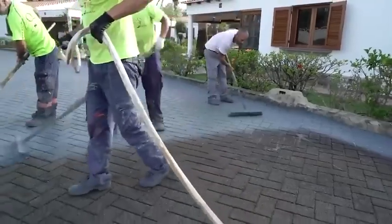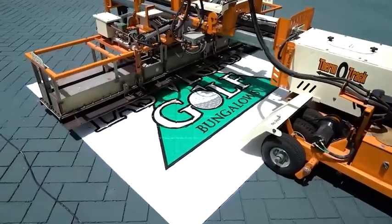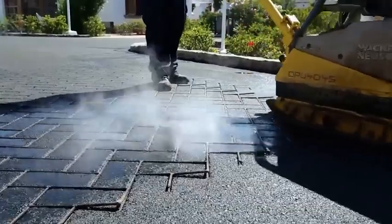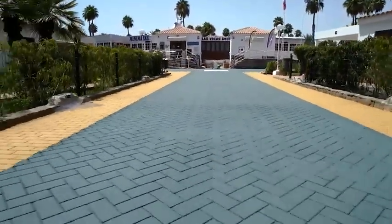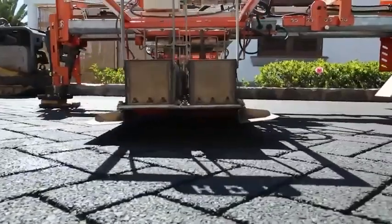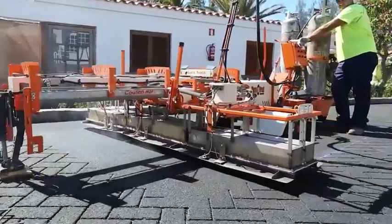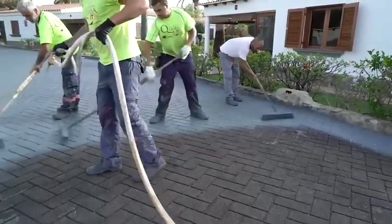By the way, these coatings are not only aesthetically pleasing, but also change the characteristics of the asphalt to a large extent. For example, coating with an admixture of sand is ideal for resorts. It looks great and it's more difficult to slip on it. Ultra bond coating will not let the asphalt get too hot, and it will be comfortable to walk on, even barefoot. In addition, the asphalt will be easier to clean, and the special resins in the composition will avoid rapid deterioration of the surface.